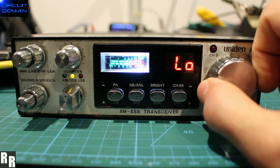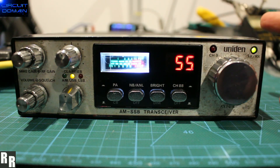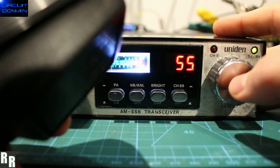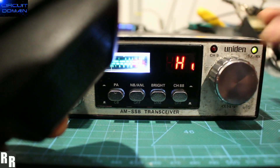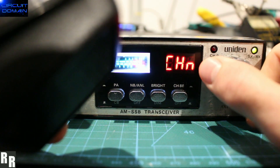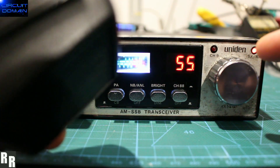When you want to turn the split function off, you just select off and hit enter. Let's go below. We're on channel 55 — if we go down by nine, that's 46. If you want nine channels above, that would be 64. To turn it off, same three button press — you always have to select how many channels to separate by, then simply select off. When that's chosen, it will now be transmitting on the same channel you're receiving on.